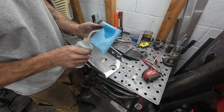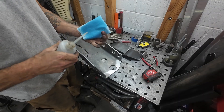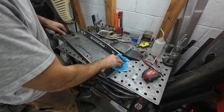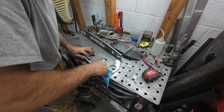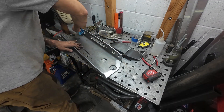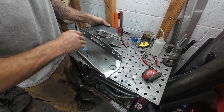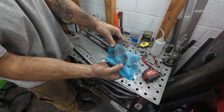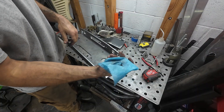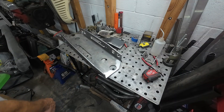We're going to clean the metal because we've got to weld this thing together and everything welds better when it's clean. Welders don't like chomping through that mill scale if they don't have to — especially TIG welders — and we're going to TIG weld this.